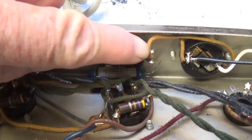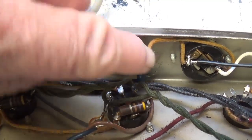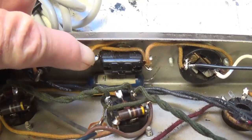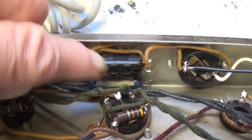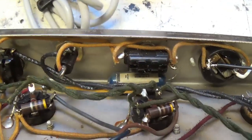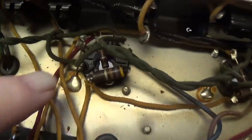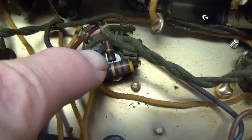As I suspected, they're using that polarity switch simply as a terminal strip. You see the wire comes over here, connects, and then continues. Now what we've got to do is eliminate those connections. Run this wire straight over to the power switch and liberate this completely so that we can use it for our switchable negative feedback loop. We need to replace the screen resistors and grid stoppers.